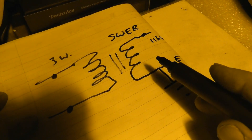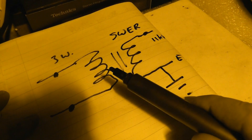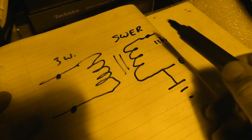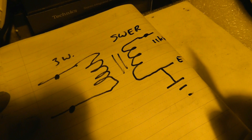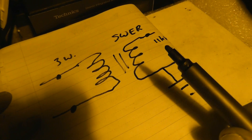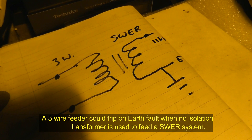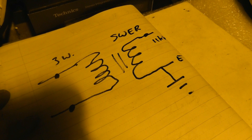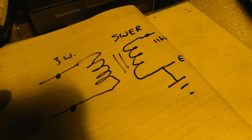And the secondary winding — the whole reason we put in an isolating transformer is to minimize tripping on the feeder. So if the SWER line falls down on the ground, the feeder would trip because it sends an earth fault, and it depends what the setting on the earth fault relay is — say whether that's 6 amps, 20 amps, 30 amps, whatever. So SWER isolating transformer, single wire — it's cheaper to run as well.